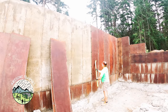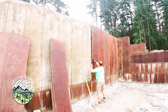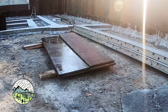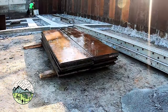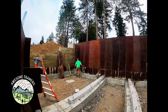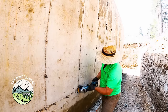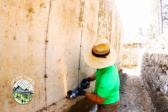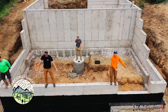The panels come off easily in part because we really oil them with a product called JHA Strip — works really well at preserving the panels. We stack them and oil them as we go, really bathing those panels in oil. The better they're oiled, the longer they'll last. Here's a time lapse of taking that wall apart — all told it took about two hours for four of us to strip all the panels, scrape them, oil them, and clean up. Then I like to grind off those snap ties — the grinder works really well, doesn't damage the concrete or spin the snap ties.